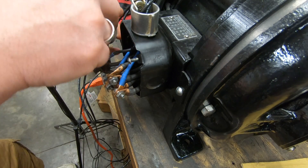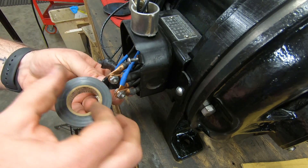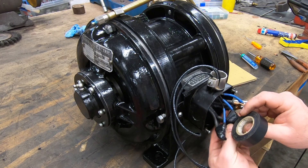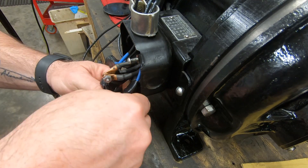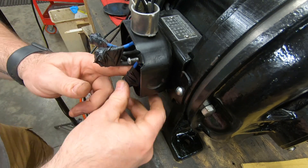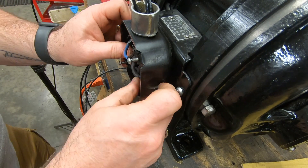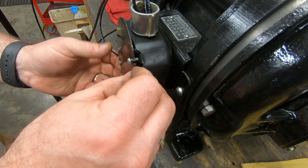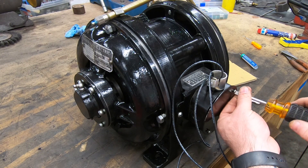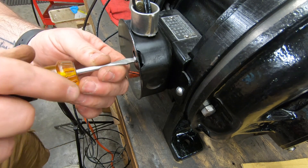To insulate the connections inside the pecker head I am using standard electrical tape. I know there are some better options — Steve Summers in his rewire video mentioned another type of tape — but I don't have any of that so I'm going to make do with what's in my tool box. Interestingly, when I originally took apart this pecker head and disconnected the wires, underneath the tape it almost looked like there was a putty or rubberized material completely encasing all of the copper and connections. I had never seen that before. I'm curious if you know what that was — leave a comment. I'm interested in learning more about how they would have insulated these wires back in the 40s.